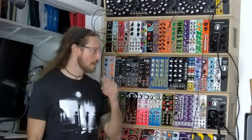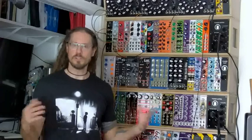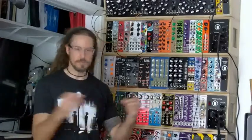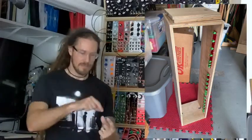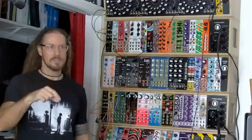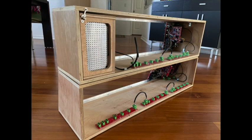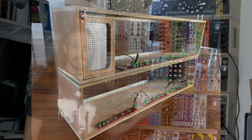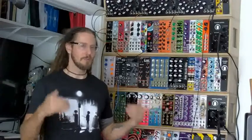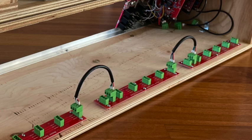And the last thing I want to mention here, the power distribution that I do in my cabinets is pretty straightforward. I get these great little distribution strips that are just using that Phoenix style plug. There's no surprises. Each switch has an inlet, one that they designate for your power connection. And when I initially did this, again, talking about radial power distribution, I was still under the mindset that I would want a jumper from one to the next to the next to the next. Because the way these things are built, it just sort of tricks you into thinking that's the right way to do it.